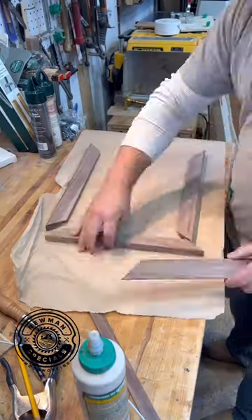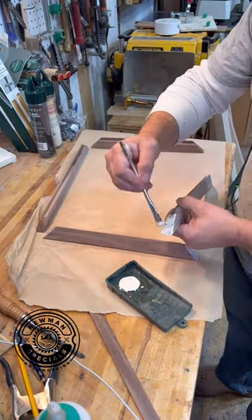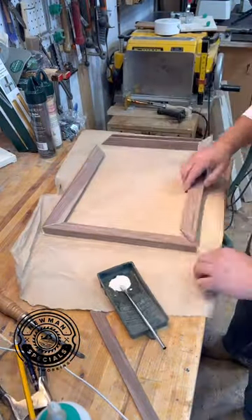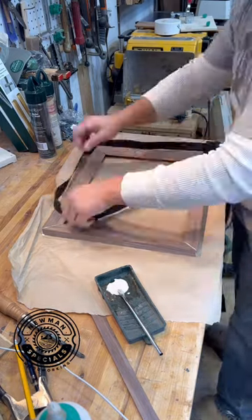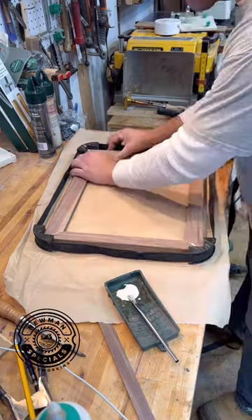Now I've got to glue up everything, and I really cut this short — I did not show gluing all the corners. I actually like to put glue on twice for the corners because it seeps into the end grain. But the key here is this strap clamp that'll hold everything tight at the corners.